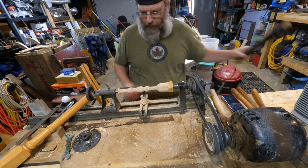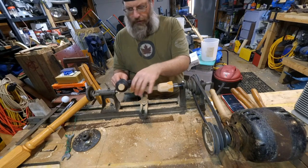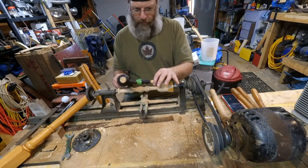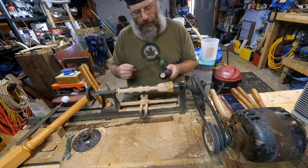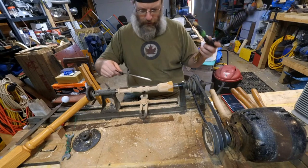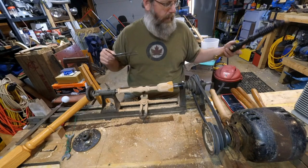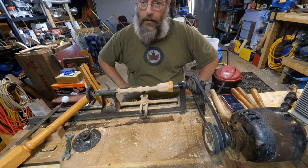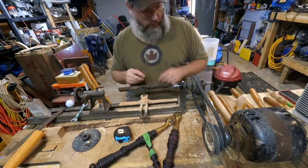We're making some serious progress here — this is what I would consider close enough. It's gonna get a little bit of sanding and I just have to get the tenon ends down to pretty close to the right size. Returning to the calipers — I have them set a little bit bigger than the tenon, so I'm going to ease those down enough to just slip it over. More turning — this is fun. I recommend giving it a whirl because it's kind of fun.